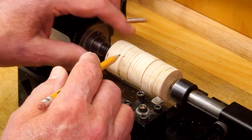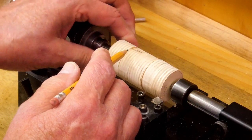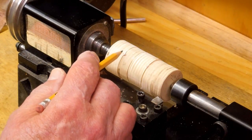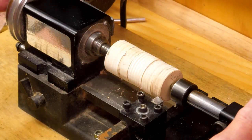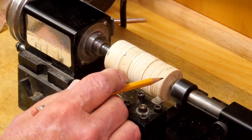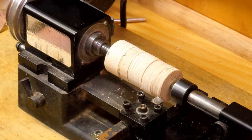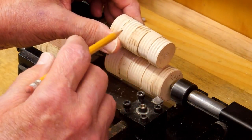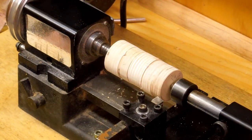I've stacked these together using pieces of paper at approximately 120 degrees here, here, and here, with just a little bit of glue on both sides of that paper — just to hold this in alignment. It's being clamped by the force of the live center on the lathe. I want to turn this to an even diameter and sand it smooth on the outside, and also turn this to 1/2 inch outside diameter. Ultimately these will be the plungers that work back and forth in the pneumatic valve.